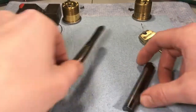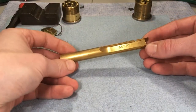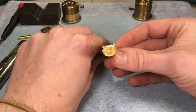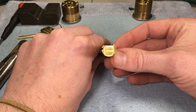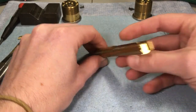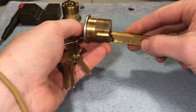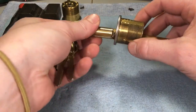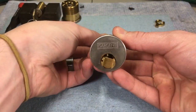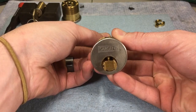Second method. I'm not going to need a follower and tweezers. What we need is what's known as a master follower — this one is made by Keydex. Very similar to a regular follower, except it's not completely round on one side. For about half the length of the follower it's got a cutout or recessed section. We're going to load it with the cutaway portion facing into the cylinder and set the plug to the side.